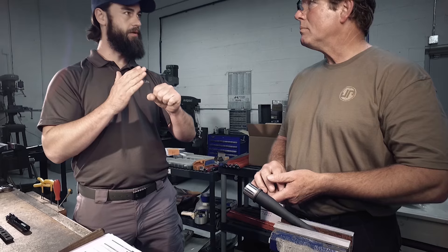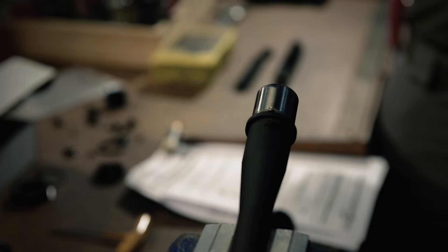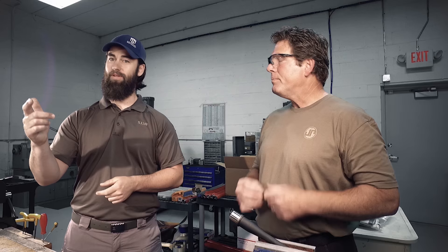How do you get the accuracy in the barrel and the upper receiver to match up? With a lot of lower-end kits, even mil-spec, there's a little bit of wiggle. You guys do something different — we call it thermal fitting. The idea is to make the mating surfaces between the upper receiver and the barrel extension as tight as possible. In fact, we make it so tight you won't be able to pull a barrel out — we use a 20-ton press to press barrels out if we have to redo one. So you don't get that shift from point of aim to point of impact.